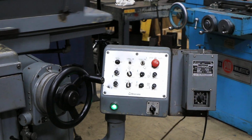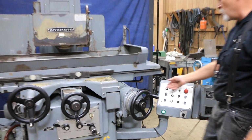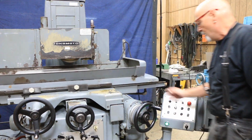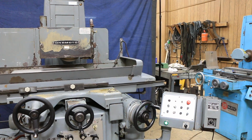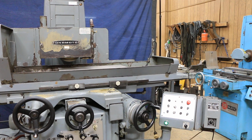And when we get down to 0, now the amount of this increment, there's an adjustment on the side of the wheel head housing here, of the hand wheel housing, to adjust this amount. Now that's the end of the feed. It's reached 0. It's just doing empty spark out passes, and when its time is up, it'll park.